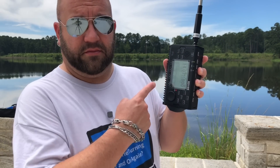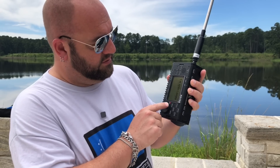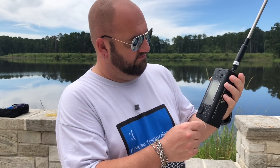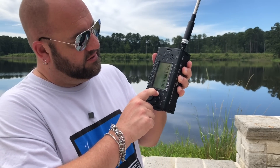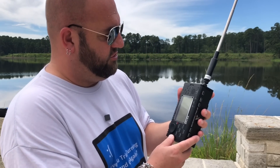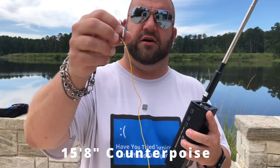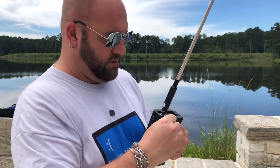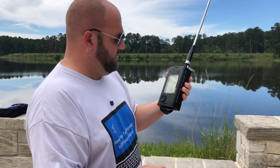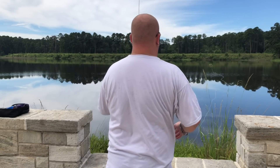We push it on — we're hearing the dulcet tones of FT8! SWR is peaking between 2.0 to 1 and 4.0 to 1. Let's turn on the tuner — I bet it'll work. Yeah, maybe 2 to 1 there — not too shabby. I made a counterpoise: I took some 26-gauge wire and hooked it up to this little alligator clip. It's not the right length counterpoise — I just clipped it on there to the base. Doesn't seem to matter; we'll use it anyway.